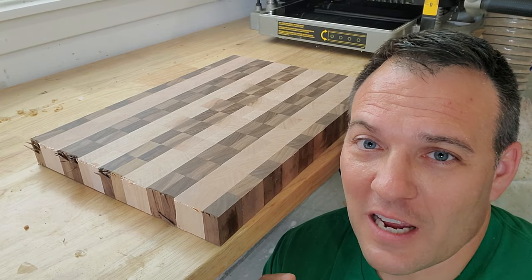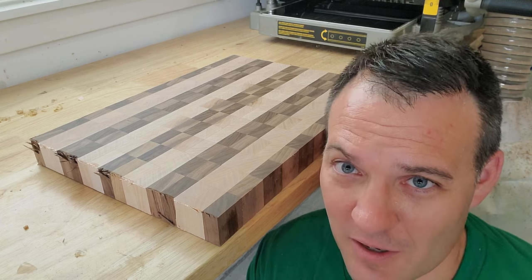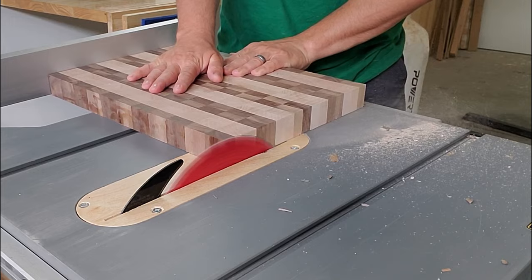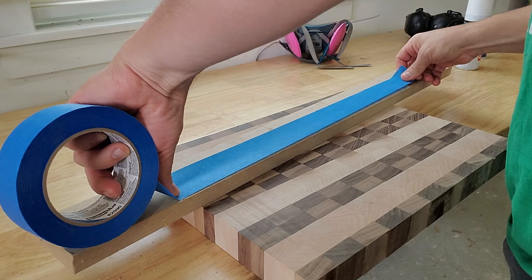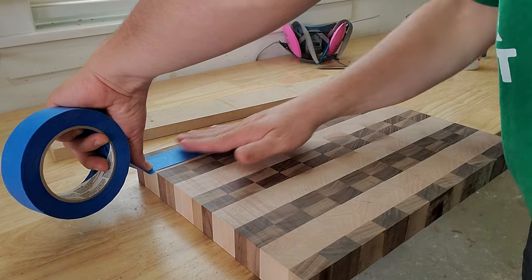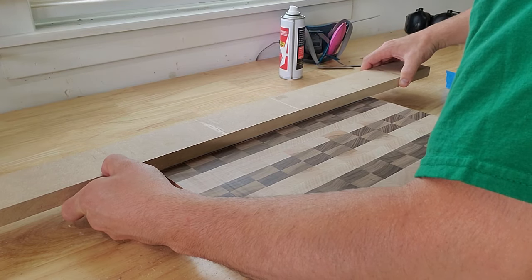This isn't really that big of a deal though — what I'm going to do is take the table saw and just clean up that damaged edge, which is why I kept passing it through in the same direction. I wanted all the damage to happen on one side once I saw it starting. If I were to do this again, I would have squared up the long edge with the CA glue trick and then cleaned off the short ends on my crosscut sled — that would have ensured the corners were perfect right angles. I ended up getting lucky and they were still pretty much spot on.